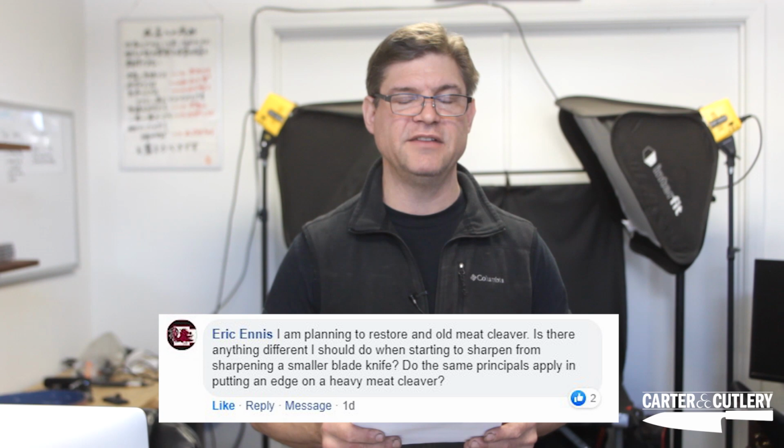Look, with a heavy meat cleaver, unless you are a glutton for punishment, I had one come in the other day. It was a huge two-handed jobby, really thick and really rusty. And I just used a power tool. Meat cleavers, by their nature, you're cleaving, you're chopping, and you don't want very thin edge geometry. So there's a lot of mass down there to keep the edge from folding or failing under the impact. First of all, because there's more metal there, you can use electric grinders or angle grinders or whatever you want with little risk of heat buildup.